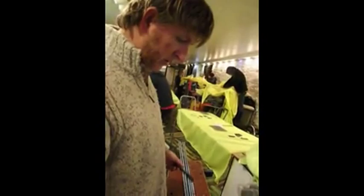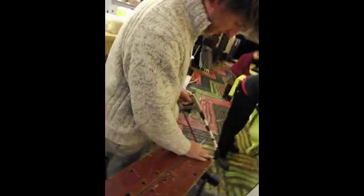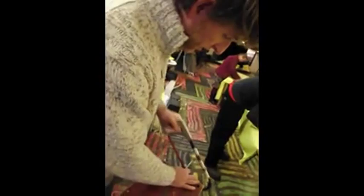Cool. What do you use this for? To make the tube into a loop, you put the piece of studding into the end of the tube with a bit of tape, bend it round, and then plug it. It just links the tube to itself. Okay, cool. We'll have a look at it in a minute. So we're just cutting the studding with a metal saw, using the full length of the blade. Let the blade do the work rather than forcing it.